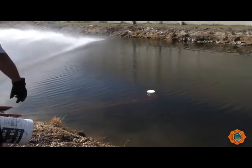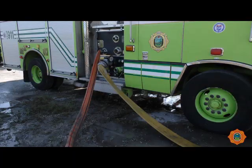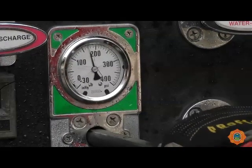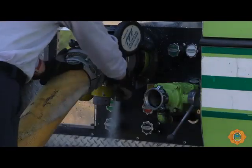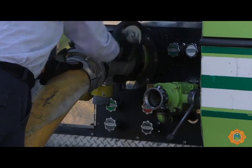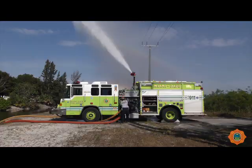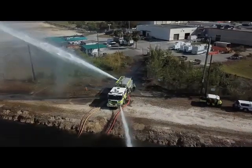After establishing a water supply from the first water jet eductor, lay out the second unit connecting the hose lines to the truck's officer side connections. Using the first unit as a supply, charge the second unit's 3-inch supply line. Once the second unit's 5-inch line has been bled free of air, slowly open its pump intake valve. Begin water supply operations by slowly opening the required discharge valves.